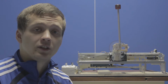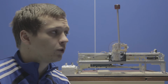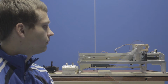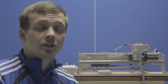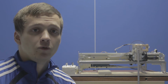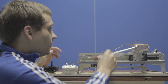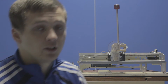So now I've increased the D gain to a value where it would potentially solve my overshoot problem, but you're going to see what happens if I bump the pendulum now. You see, the pendulum goes nuts. It just goes back and forth, the movement becomes jerky, and it just oscillates out of control. So I'll disable the potentiometers and go back to my saved values.